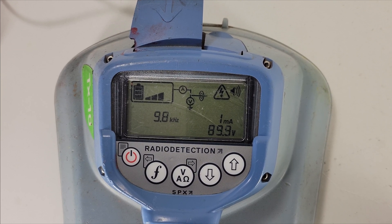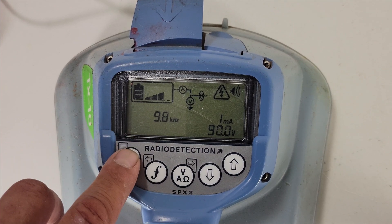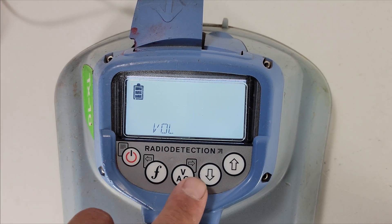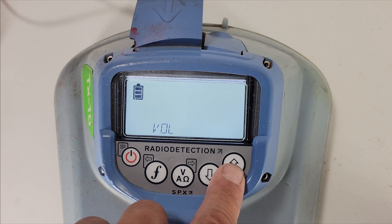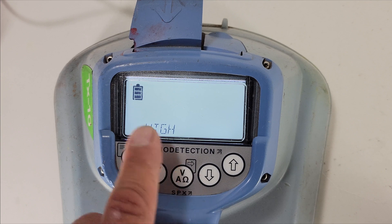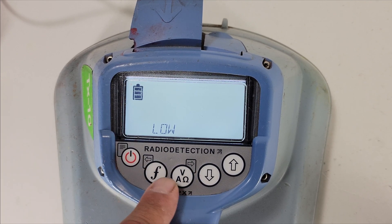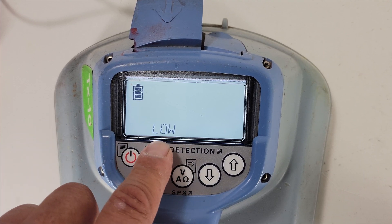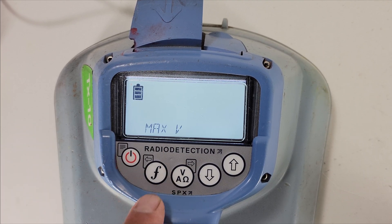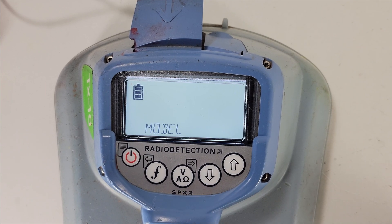To get back into the menu, hit the power button. That's the volume we went through, and that's max voltage. Hit the V key to get into the max voltage setting and set it back to low — it will default to low for you. Hit the V key once again to get back out. Now you're in the menu system.